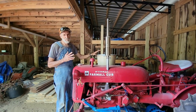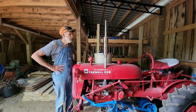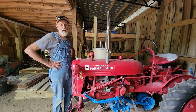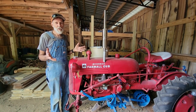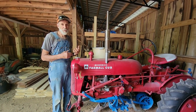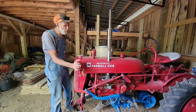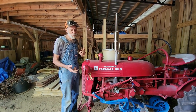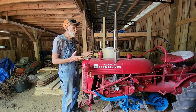Before we do, we're only going to take the hoppers off of the planter and the fertilizer because there's no need to have them on there — they'll just be in the way. The reason we're doing this is where we live, I cannot get a 6 volt battery. I spent almost a month getting one here. Tractor supply doesn't carry them, none of our parts houses carry them. I ordered the battery I have and it took almost a month. When I got it, it wasn't even charged. And I keep having problems — I have to have the headlights turned on for the generator to charge, and if I wind on it very much and it floods a little, the thing goes down and won't hold a good charge.